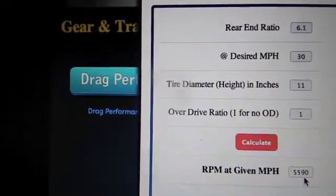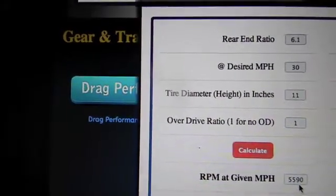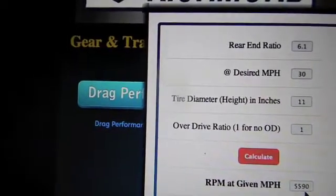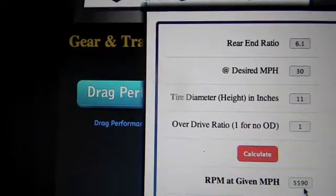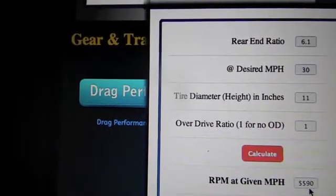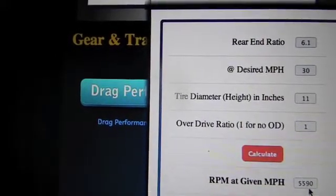That's what I based everything on, because the 5 to 1 is too dogish out of the hole, even though the two engines will help it. There are two 3 and a halves on there, which are actually three and three quarters — they've always been mislabeled, that's where the lawsuits came from. And that's only a 3,600, so I know they're at least four horse or better when you start to scream them up.